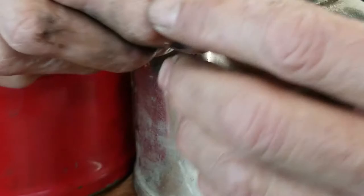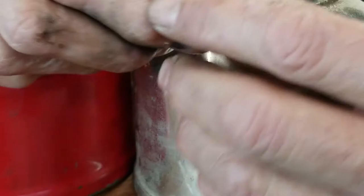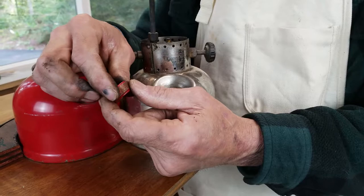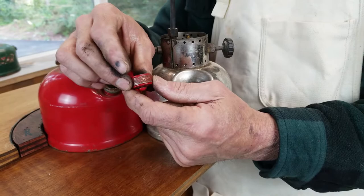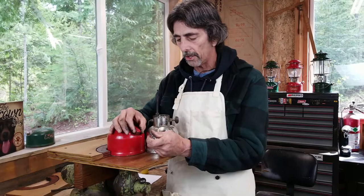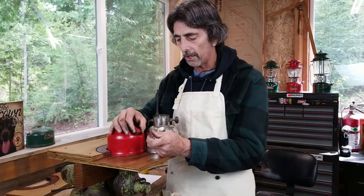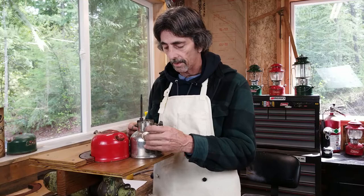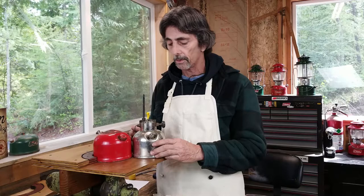The cap without the hole is safer than the one with the hole in the side. The 242 was made much prior to 1963 — this one does not have slots and it has a hole in the side. This is so dangerous. Unless you have to use it like a 242 where replacements aren't made, if you have a cap like this I absolutely recommend getting a replacement cap. When you start releasing a cap like this that's full of pressure and gas, all the fuel has one place to go — out of that hole, which could send a stream of fuel up into the lantern.